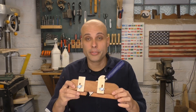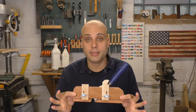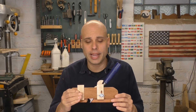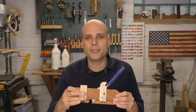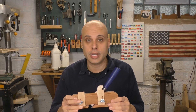A chisel, a couple scraps of hardwood, a couple random pieces of hardware — and we have an excellent little joinery plane that will plow a groove into pretty much any piece of wood. And instead of making a big complicated plow plane, if I needed another size groove, this wasn't very difficult — I would just make a second one of these with a different size chisel. Definitely two or three of them would cover everything you could ever need.